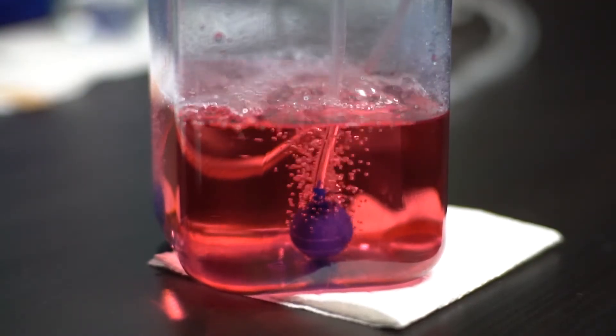We've already raised the pH from a yellow color to a slightly orange color, which means we've already gotten from maybe 6.8 or 7.0 up to 7.2 or maybe towards 7.3 already. A 7.4 is usually what we think of as a rose wine color — right about that color is 7.4. If we leave this going it will go all the way up to about 8 and the sample will turn red. This points out that you could do this in your swimming pool and raise the pH without affecting the alkalinity. This is huge because it allows you to take the pH and alkalinity of your pool down to a target level of 90 for alkalinity, then raise the pH back up simply by aerating the pool.